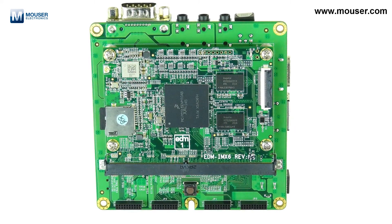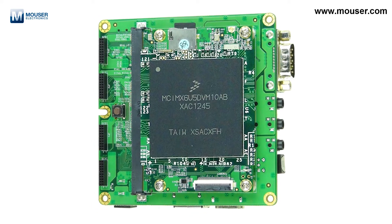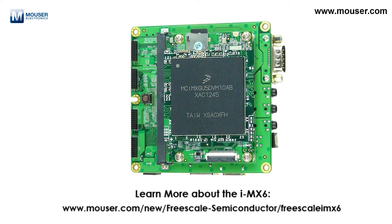On the processor board you have the Freescale IMX-6 series processor. On the quad version you can run it up to 1.2 gigahertz. Really the entire series integrates just about everything. There are some differences from the solos to the duals, the duals to the quads, but as far as what's integrated you have 3D graphics, 2D graphics, 3D HD video playback, SATA 2, and more.